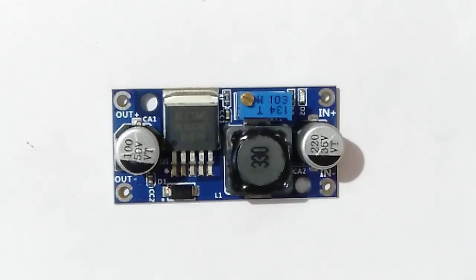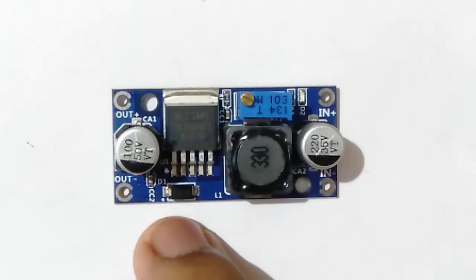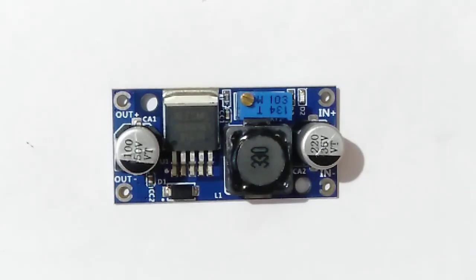The task of this reverse polarity diode is that it opposes reverse polarity and avoids damage to the MOSFET driver circuit. So the last thing you want to test for damage is the XL6009 IC itself, and the first thing you would want to test is this SMD component, the reverse polarity diode.